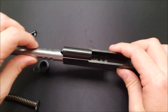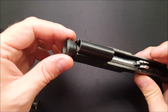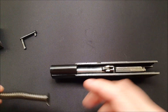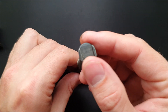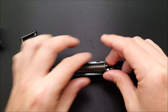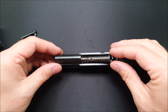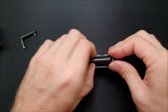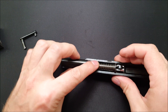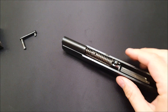Why don't we put it back together? Put the barrel back in, slide it until it falls down into the recesses there. Grab your barrel bushing, pop it in, rotate it to the correct spot. Getting the recoil spring and guide back in is a bit tricky — that round part has got to go against the barrel. Stick it in there, get that link out of the way — that little oval piece — then push it in so it goes into the little recess in the front of the barrel bushing. Once it's all in, it'll just kind of feel like it's in the right spot.